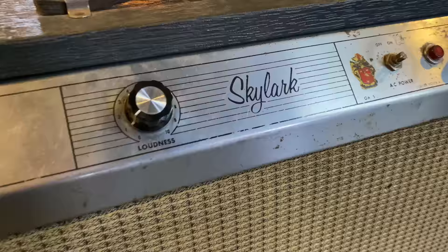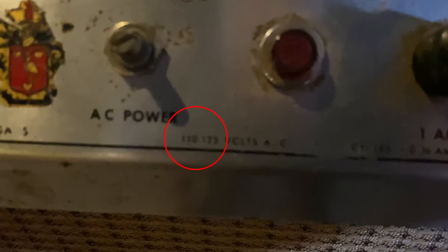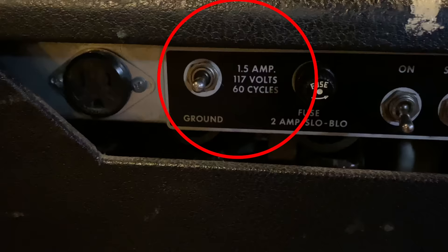All the contemporary amps are rated at 120 — that's the normal setting. But the two amps next to Rhett are different: the top one is a 50s Gibson Skylark, which is rated at 110 volts, and the Fender Super Reverb under that is 117. The Blackface and Silverface Fenders are 117. The idea is to see if matching the voltage actually affects the sound — I've always wanted to try this. We're going to reduce it down to 89, which Eddie talks about in his interview with the Smithsonian. Let's go in the control room.